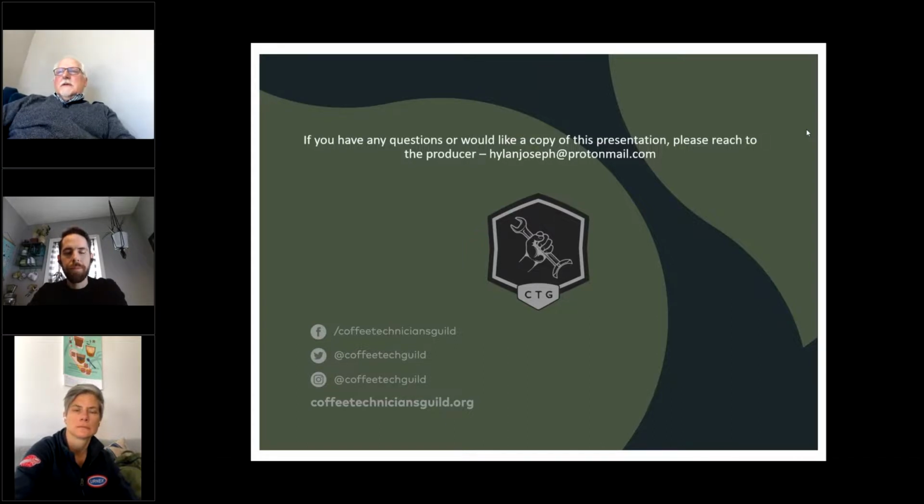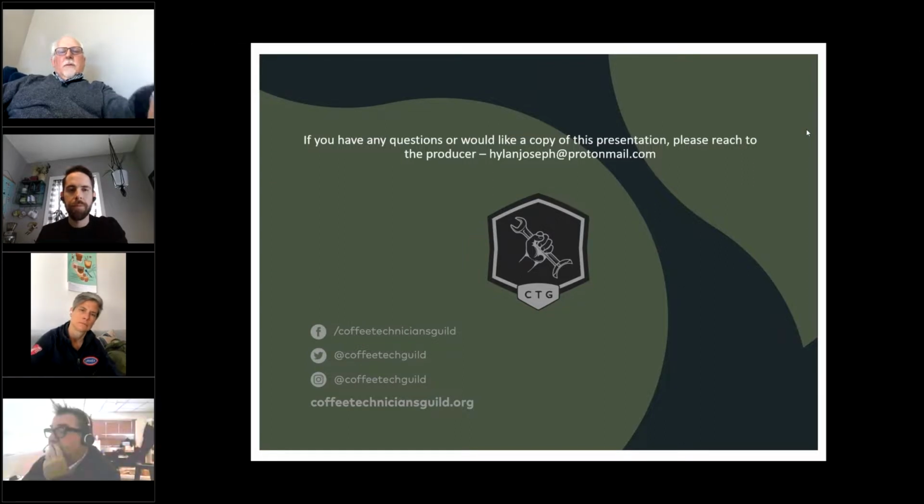In terms of tracing it down, it's like a maze anyway. So start where you don't have power and keep going back until you do, or start where you have power and go forward until you don't. And that's kind of where you're going to find it. The common leg is not generally in parallel, so it'll go from one component to another, to another, to another in series, and loop all back to itself.